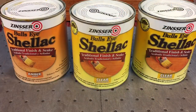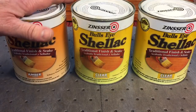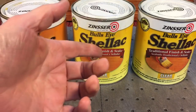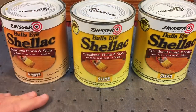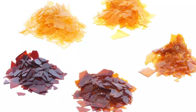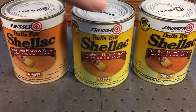A quick introduction to what shellac is. Shellac comes from the word lac — it comes from a female lac bug. What they do is they excrete resin onto trees in India and Thailand, and they take this resin and make it into a coating. This coating has been used for a hundred years. Remember the old 78 records? They used to be made out of shellac or lac resin. The resin comes in flakes, and what's interesting is the lac flakes come in different colors, so you can adjust the color of your shellac — we use clear. You dissolve the flakes in alcohol and then you make the shellac.